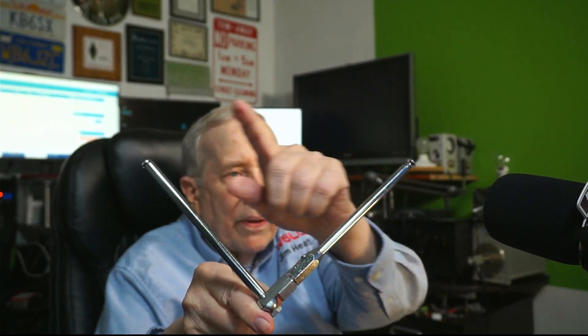Let's say that we configure this and put a wire from here to here, and that wire allows you to make this whole thing one full wavelength. What happens? Well, there are no open ends, so there's not a lot of noise. It's a fairly efficient loop and it has some gain. So a quad or a delta loop — with a quad having four sides — can be a fairly quiet antenna compared to a dipole, and a lot quieter compared to a vertical. The gain across here could be a couple of dB, and adding another element you could have 6 dB.